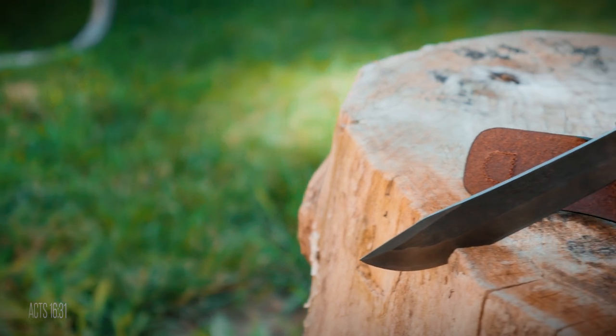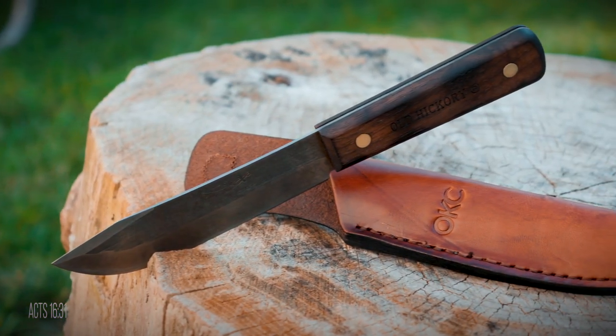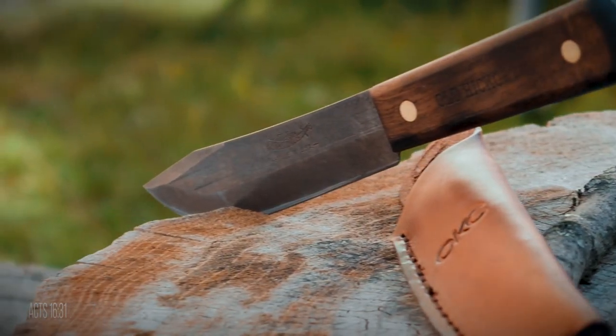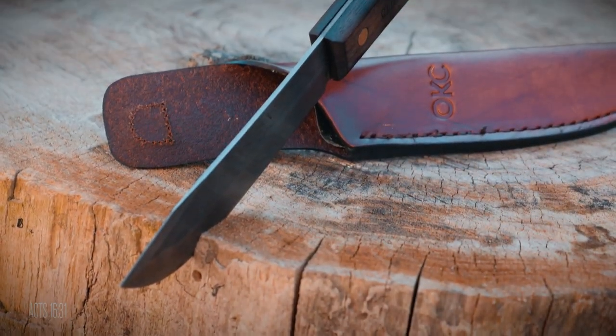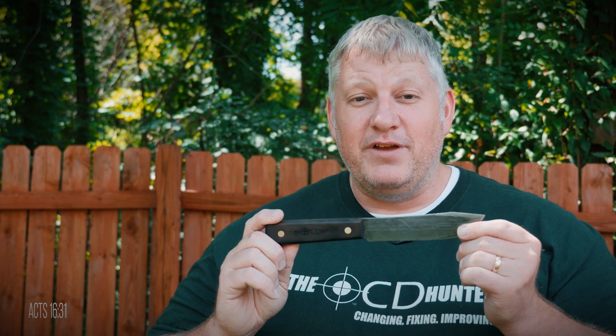Here is my finalized modded knife, which includes changing the shape of the bevel to give the knife a thicker apex at the tip, a 90-degree sharp spine, a marbled patina on the blade, an antiqued look to the wood handle with some wood burning, and finally a pretty bad carved logo in the handle. So there you have it — my modded Old Hickory hunting knife. I think it's ready to be field tested. If you want to see the field testing video, click the link at the end of the video or see the link in the description.